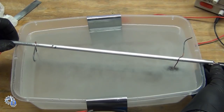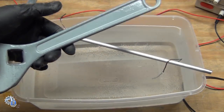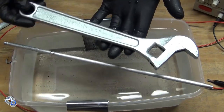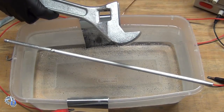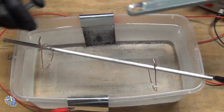After the wrench is neutralized and rinsed off, I start the zinc plating. I lightly vapor blast the wrench between layers of plating. The zinc plating solution itself is a homebrew mix consisting of 1 liter of 5% white vinegar to 100 grams of Epsom salts. It also calls for 120 grams of sugar to brighten the finish, but I've never found that does anything except make everything sticky.